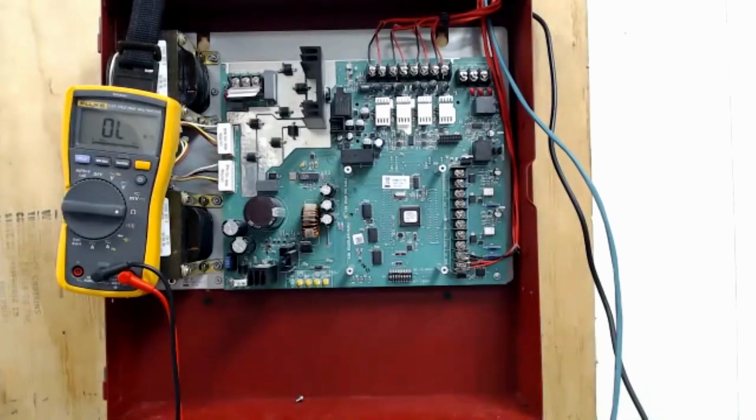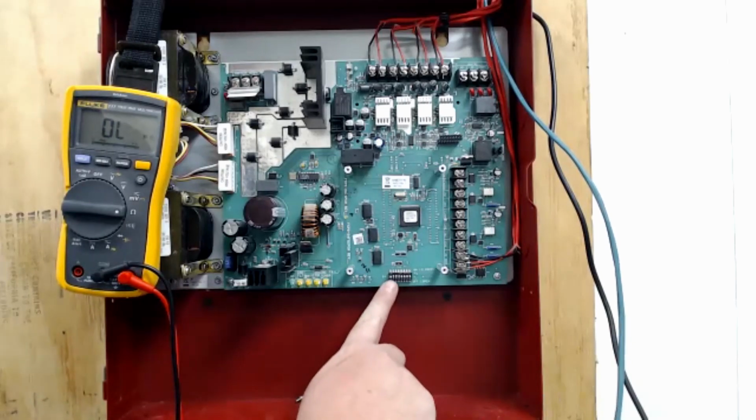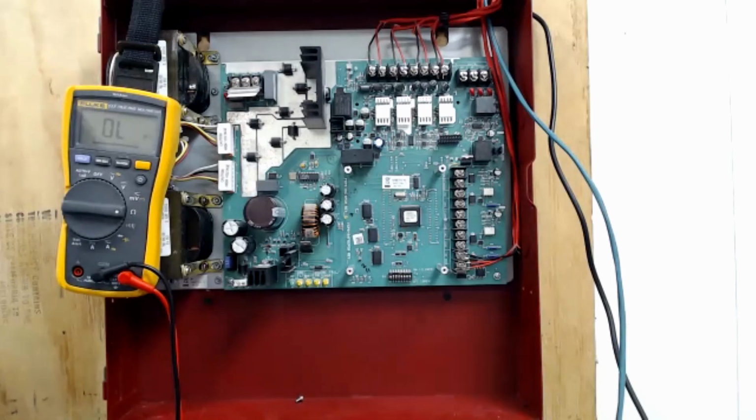So for this one, I'm setting it up where all 4 of these are going to be your typical NAC circuits. They're all powering strobes, and it's following a sync signal. So we're going to have 1 down and 2 up for system sensor sync, 3 up to be a NAC follower, 4 up for that AC power delay, and then everything else turned off for normal operation. So that's a really long-winded way to explain the dip switches. But that's how any panel that has dip switches works. You've got to read through it, go through it switch by switch, and set it to what you need.